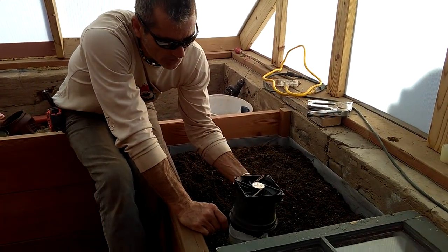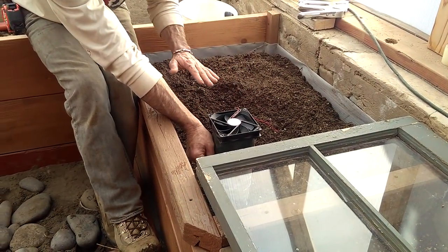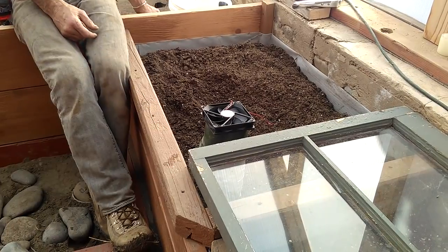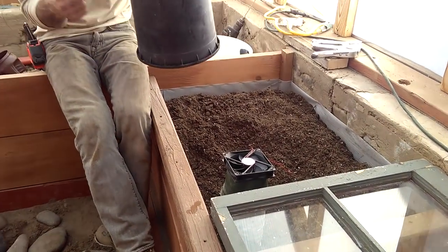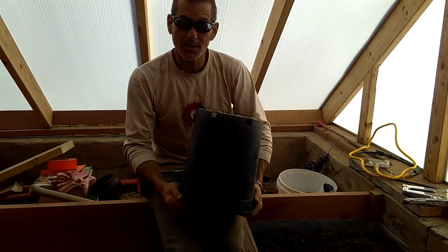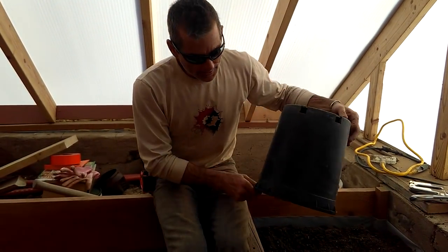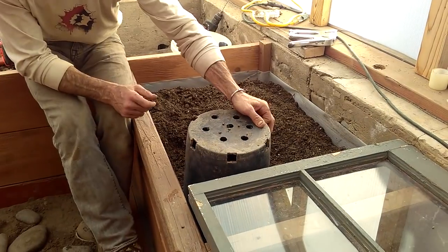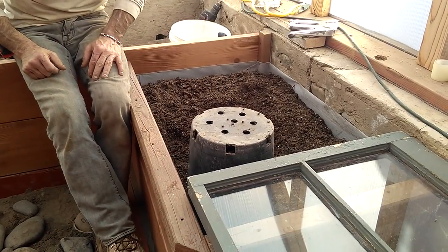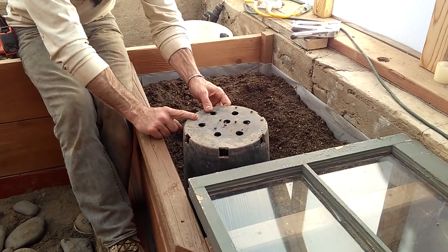All we do is slide this on here, wire it up to a switch, and duct tape it — making sure there's good clearance everywhere. The key is to keep this thing from being hit because it's very delicate. The way you do that is get a really heavy two-gallon perennial pot — one of the super duty ones, costs about five bucks. Drill some holes in it, keep the original venting, and after the system is complete you can slide this down and backfill up to it, which protects the whole unit and gives you water and dirt protection for the DC fan.